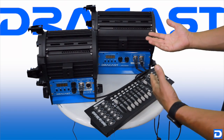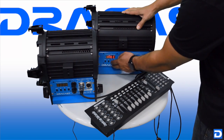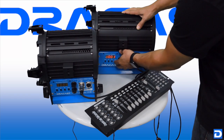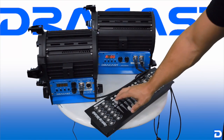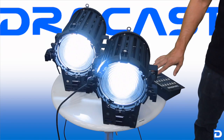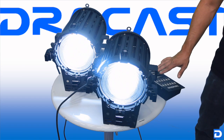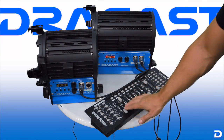Another question we hear often is: can we have overlapping channels? And the answer is yes. We can navigate to the intensity menu, go to D, and set this light down to channel 1 so it matches the other light in the chain. We save it on channel 1, come back and put it on A000 so it's controllable. We'll notice that both lights are now controlled in tandem using the same two faders. This is really convenient when you want to hang up lighting banks and need large groups of Fresnels or panels all grouped together operating in tandem. If you need different banks of light on separate faders you'd assign them differently, but if you need a large group of lights on one set of faders, you can do that by just putting them on the same channel.